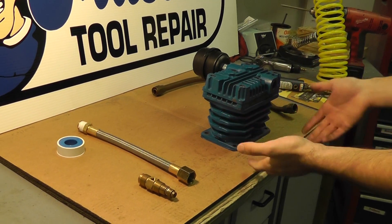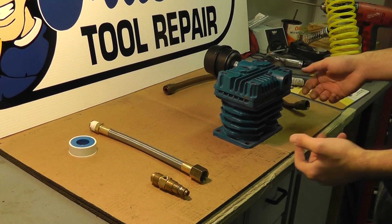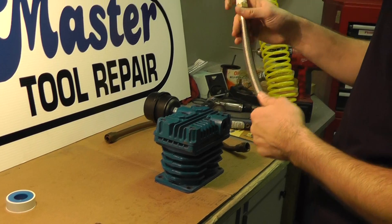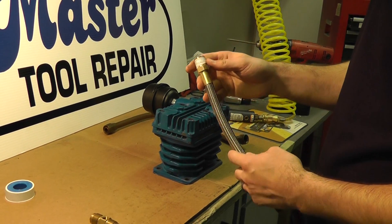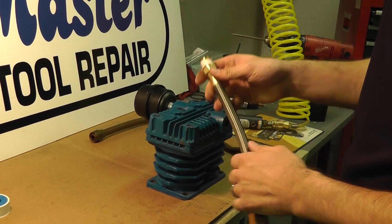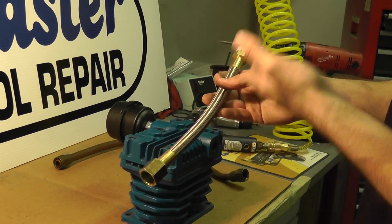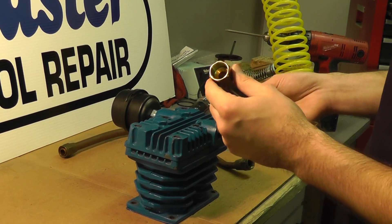Here we have just a cylinder in the head of the pump just for demonstration — I took it off of the tank. So what we're going to do here is I have a standard stainless steel tube here. This is going to be a half inch MPT — half inch male pipe thread that measures three-quarter inch outside diameter. So that is half inch MPT by 12 inches long, about a foot. You'll need to choose the right length obviously for your particular setup. This happens to be a 12-inch length that we have.